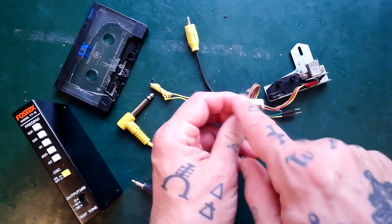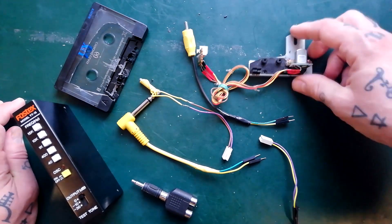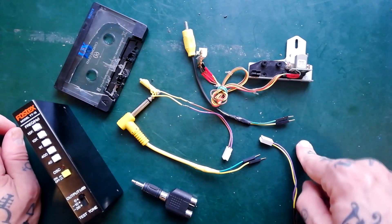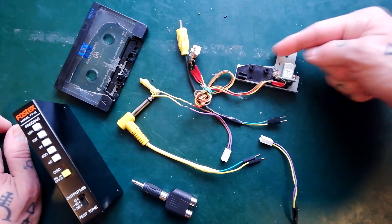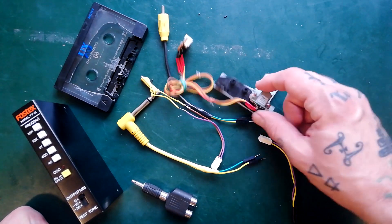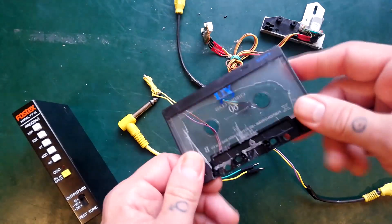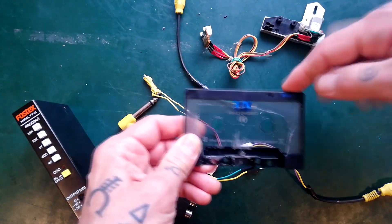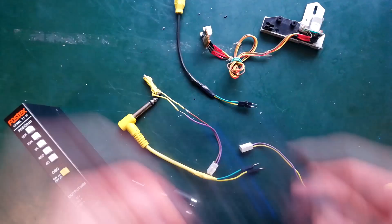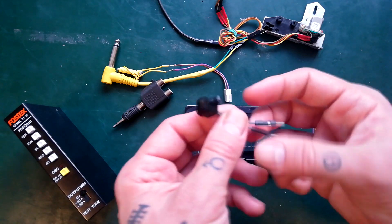It's not always convenient to stick wires into one of these plugs or even get to the contacts in the base of the head. So I want a way to send a signal in or receive a signal out of one of these without completely disassembling the unit. Doing that lets me differentiate between the head actually being broken or the tape just not touching the head properly. We know these heads can have a dual function — transmit or receive magnetic fields — because otherwise this combined record and playback head wouldn't work. So the reason for this ravaged cassette shell is to push up the record-enable and cassette-detection switches in the corners of most cassette players.